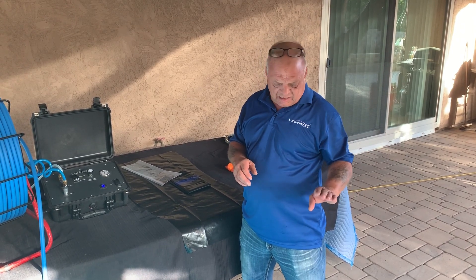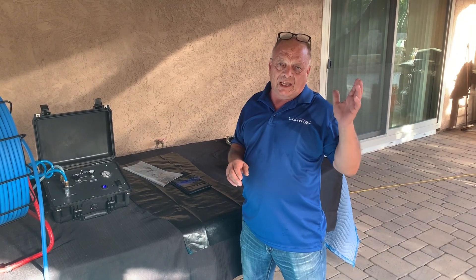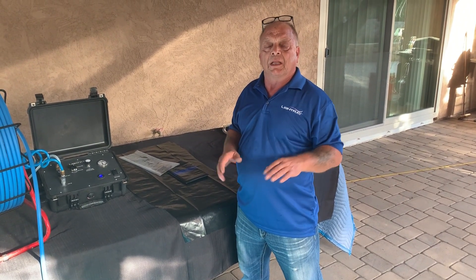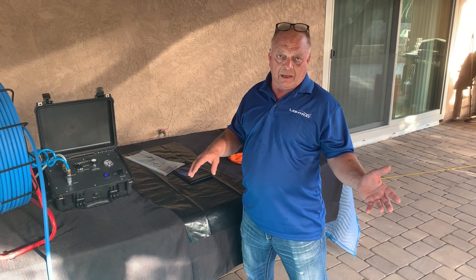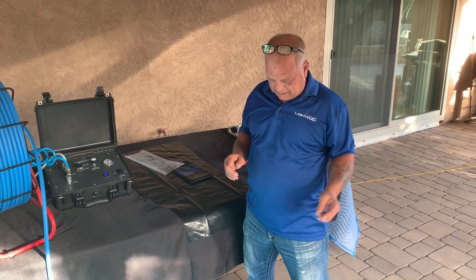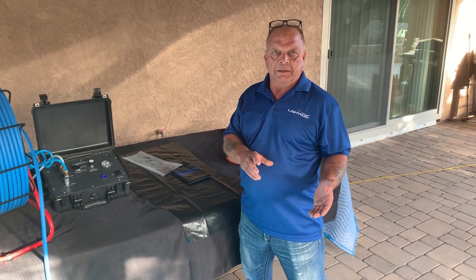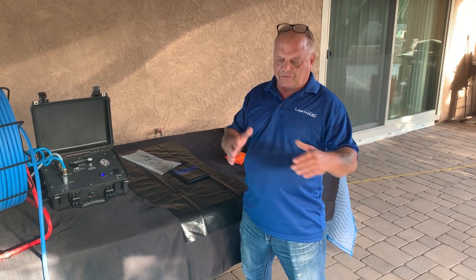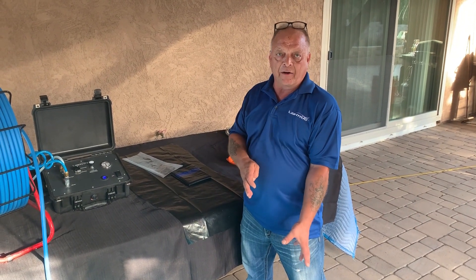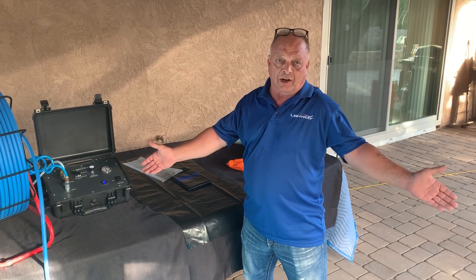People have started to make comments about vinyl esters, polyesters, all the different resins. I can tell you right now on the mainline UV system — the most deployed in Europe and in the States — when the impregnation process is done on their glass, which is another different component, they have to gel that material before they can actually install it and ship it. We can impregnate and immediately start to store it, ship it, and move it to where it's going to go. There is no resin runoff. One of the reasons for that is we use a unique glass fiber mat that's woven and seamless. That is not the same as what is in the standard UV industry — there are mats and glasses that slide and fold together to form the shape, and they're very low pressure applications. We can take this into a much higher application of pressure, 25–30 psi, which would be unheard of in trying to do an eight-inch line.